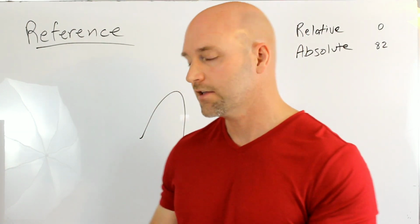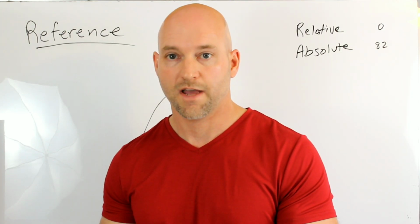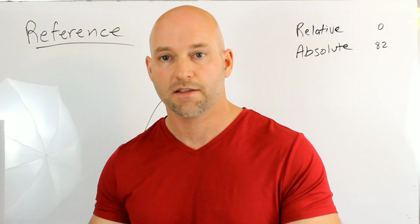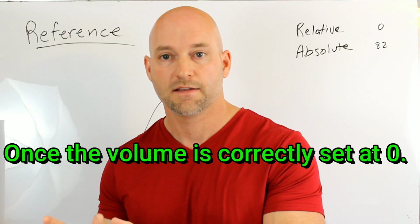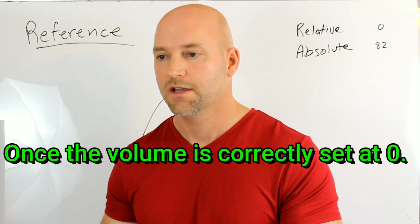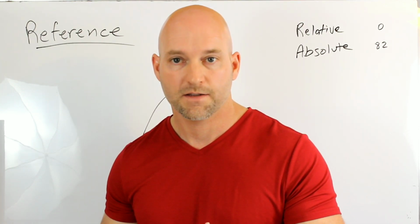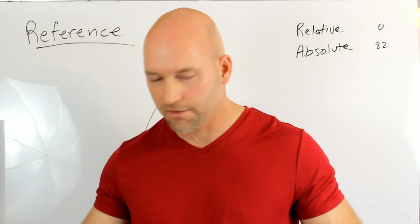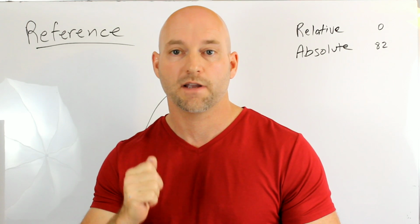All you're going to do is go to your settings where you have your speaker output levels, and that's going to play the peak noise at 75 dB. Remember, that's 30 dB down from those 105 peaks. So you're going to get your meter and put it at your money seat, at your listening position, the center of your sofa, whatever you've got, where your head goes.